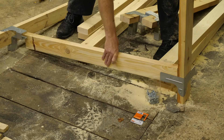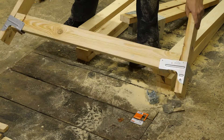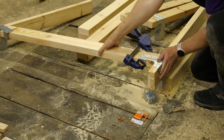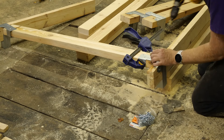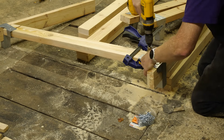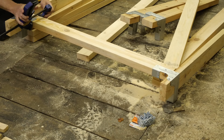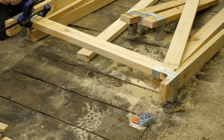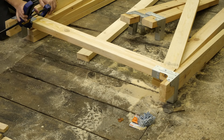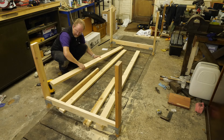Once I've fitted ties to the first pair of verticals, I line them up in position with one of the short length horizontals. The dimensions are looking good, so this end needs to be fixed up. I use a clamp to make sure the horizontal is firmly in place in the corner. The next screw to go in is the one that attaches the horizontal closest to the end in contact with the vertical. With both these in place, the end of the bench is already recognisable, and the equivalent construction for the other end goes together exactly the same way.